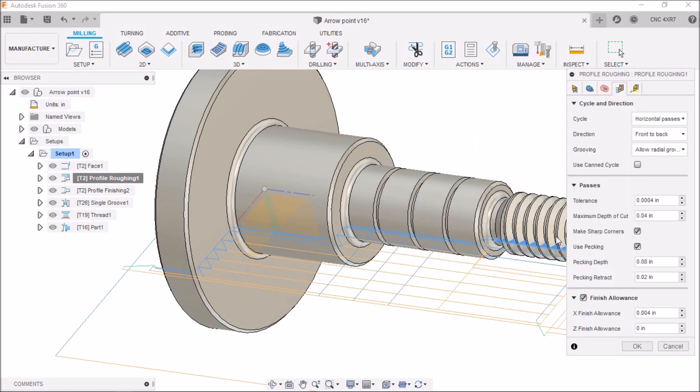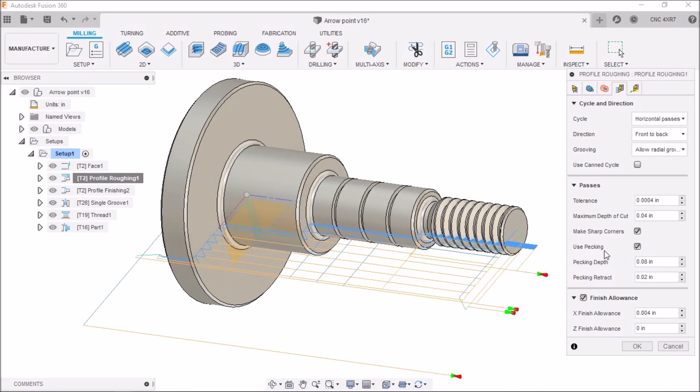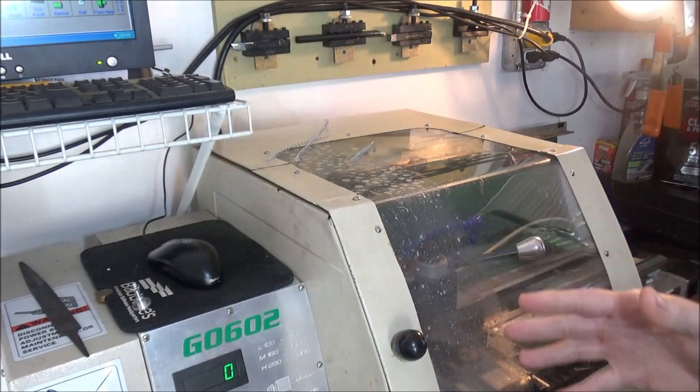It works really well as you can see in the video footage, so it's a really good feature, especially for this particular machine. A lot of these hobby CNCs are a little underpowered. I will be doing a motor upgrade shortly — I'm going to be adding a Marathon motor to this machine hopefully, and that will solve this problem. I'm not able to take deep enough cuts to get into the chip breaker on the tool. I'm taking 40 thousandths, which is 20 thousandths per side, but apparently that's still not quite enough to break the chip off. It's a nice little feature in Fusion 360, especially for machines where you can't take huge cuts.